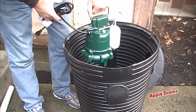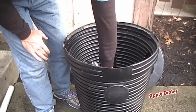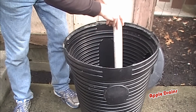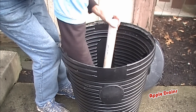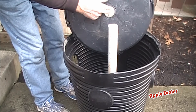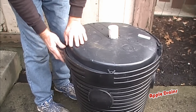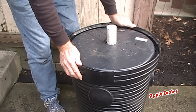We're ready to install our sump pump down into our sump pit. We're just showing how things go together — this goes down into the pit. We take our inch-and-a-half piece of PVC that we've already cut to length; that will slide into that male fitting. Of course, we're going to glue that when we put it all together. Center your pump. Remember, we've already drilled our hole for this discharge pipe, so we're going to slide the lid on. This lid actually locks in place — a lot of lids are different, but they snap in place and then you just twist it. That's locked in place.